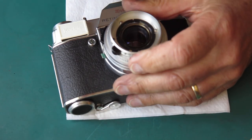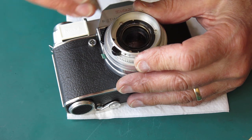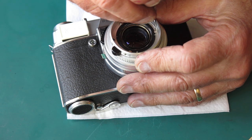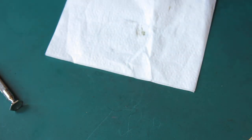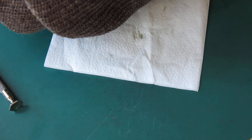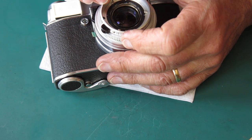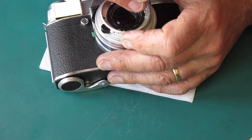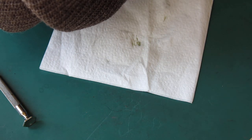That's nearly it but not quite. You could scribe lines on here before taking it apart, but given that there's a very multi-start thread in there, you'd have to start it in the right place before putting it back together — which would be tedious. And since there's a very real possibility you'll need to make some adjustment anyway because it wasn't quite correct before you started, scribing lines would only give you a starting point.